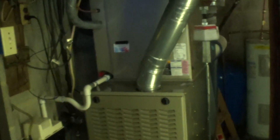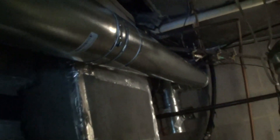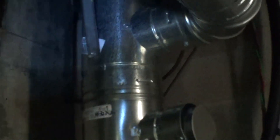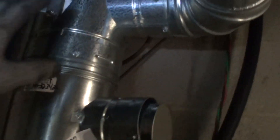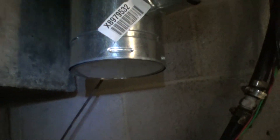Got our vent pipe in downstairs. You can see it connects to the furnace - 4 inch Class B double wall. I run straight across, then go to the 6 inch existing with 6 inch T's. I left a future 3 inch provision for the water heater, which is electric right now but could go to gas anytime. And here's the cleanout, which is required, at the bottom there.